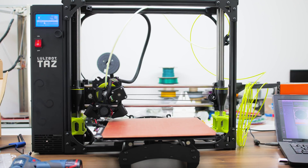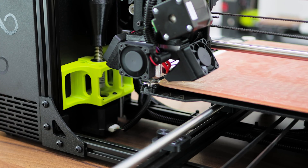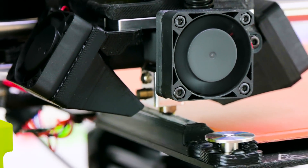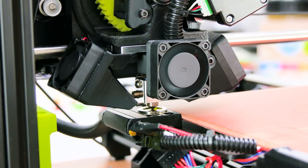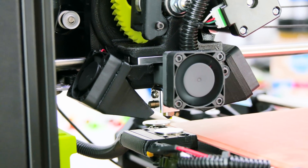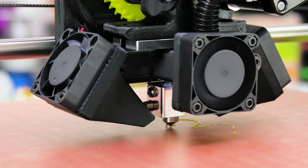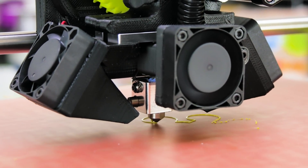And if you watched my review of the LulzBot Mini, you'll know that I love this auto-bed leveling setup. The way it works is that when the hotend and these washers around the bed touch, they close a circuit, which the printer detects and consequently knows exactly at what height that corner sits. The nozzle needs to be clean for that to work, which is why the TAZ 6 and the Mini have these cleaning pads right next to the bed, where they vigorously rub their nozzles before starting the probing process. The one thing the TAZ 6 adds over the Mini is a physical switch that allows you to use hotends with a different length without crashing anything. The system still works great on the TAZ 6 — you also now get more filament profiles that will make sure the hotend doesn't ooze out any plastic during the measurement process.